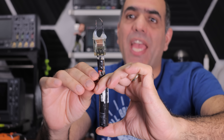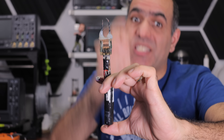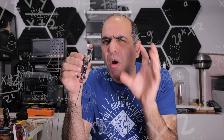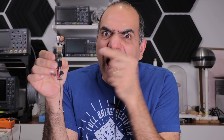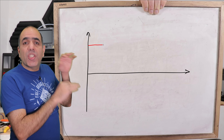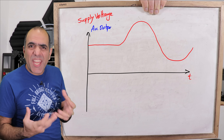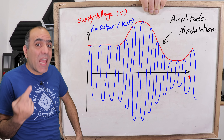From my device here running on a battery, we are outputting a fixed AC energy we can't hear. But if we change the output energy at an audible frequency, the air expands and contracts at audible frequency and we can hear it. I've done a similar thing in my musical Tesla coil video. In that one I changed the pulse width modulation of the switching frequency. Here instead, I change the supply voltage at an audible frequency, and the arc's output energy changes at that frequency — I can hear it. This is exactly what AM, or amplitude modulation, is, and why you can hear sound in the sausage-on-tower trick.